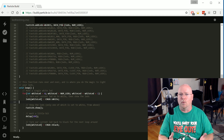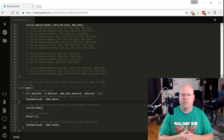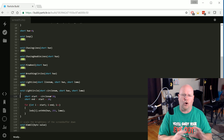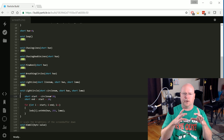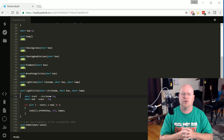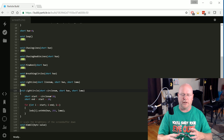To do something really interesting, you're going to want to turn more than one LED at a time on. Let me flip over to the program I've got going for the wreath and show you a couple of the functions I've built to start making this thing dance. I wanted to show you how this works when you want to deal with more than one LED at a time. The trick is you set all the values in that array to what you want a particular show to do, and then you show all the LEDs at one time. For instance, I have five circles of LEDs on the wreath — the inner ring working out to the outer ring.